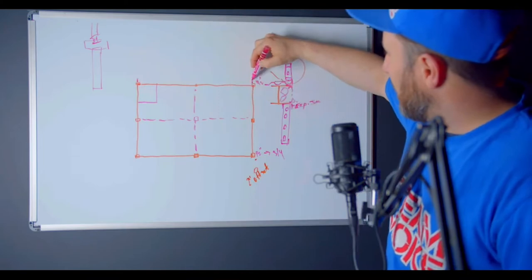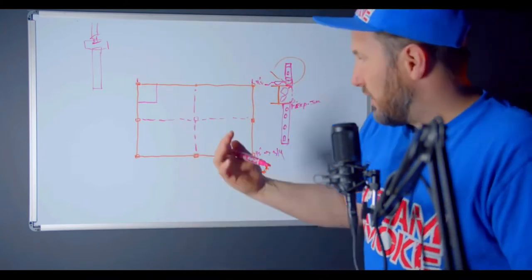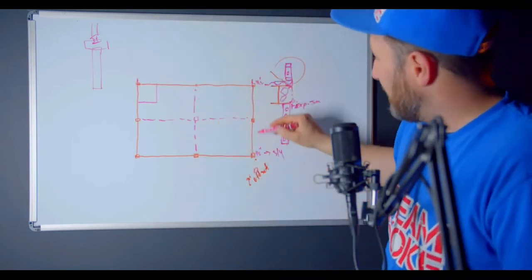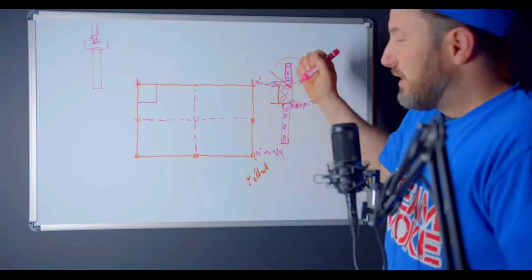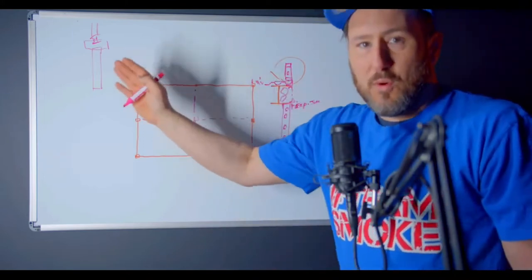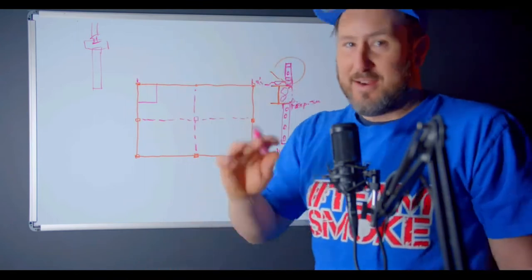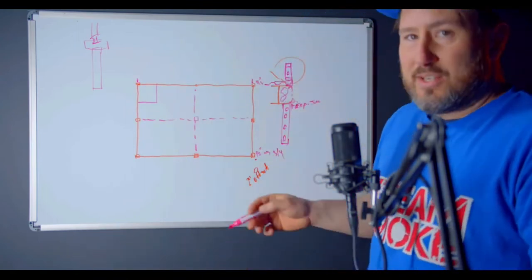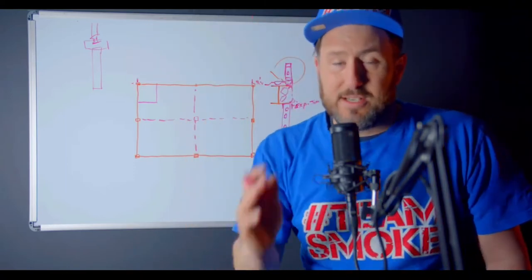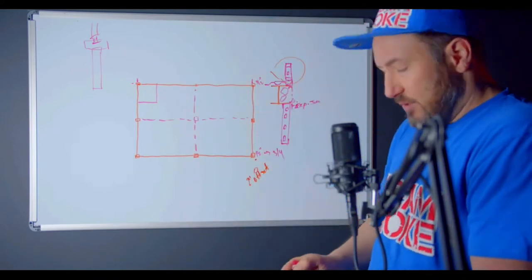And then when you're going this way, same thing, okay? If you got to bring your line out a half inch or a quarter inch or whatever, bring it out half inch, quarter inch on the other side. Just keep these two the same, all right? It doesn't matter what it is in the middle, because you want to snap your line and it's going to be straight, and then you'll be square all the way around, okay? You're not going to measure corner to corner and check square, okay? You're going to do what I just said and go the same distance from center column out, okay, to make sure that your steel is good in your board. You'll get coverage, okay? No messing around.